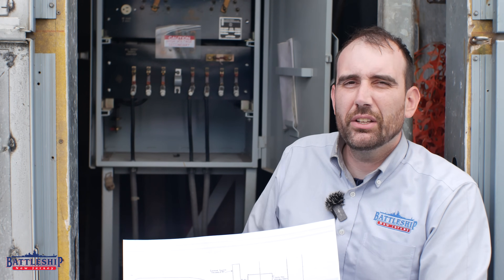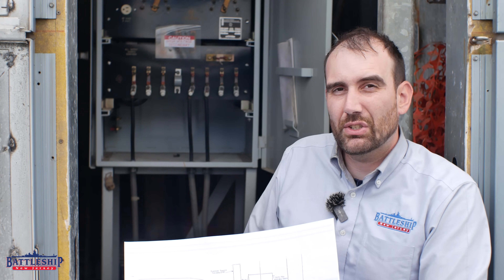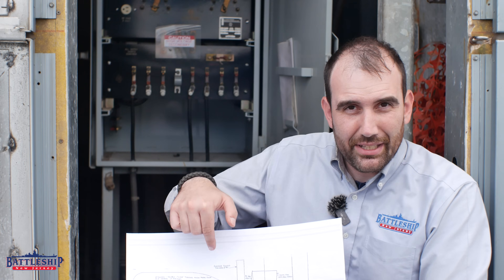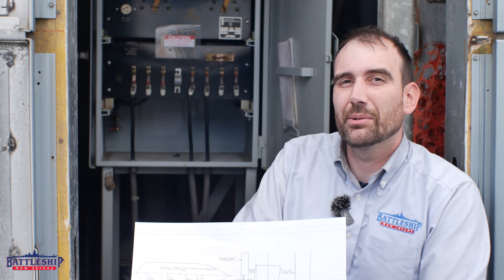These systems are usually designed to last for about 20 years. We have our anode expert from Anode Solutions come out and inspect it about once a year. We're about 22 to 23 years from when this was initially installed, so we are around the end of life for the system. But our expert comes out and tells us it's still in good shape — the anodes down there haven't completely deteriorated yet. This system is undoubtedly a large part of why the ship's hull looks like it's in such good shape, as we were able to see while the ship was in dry dock.